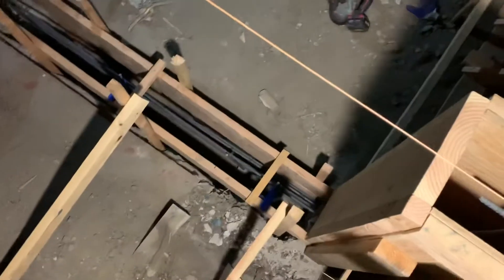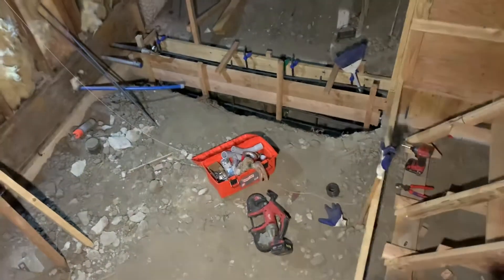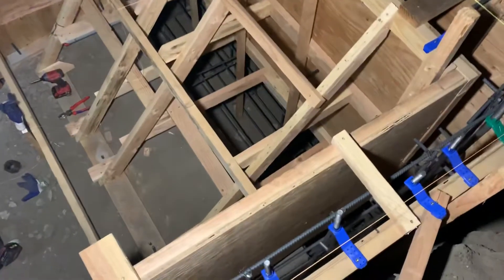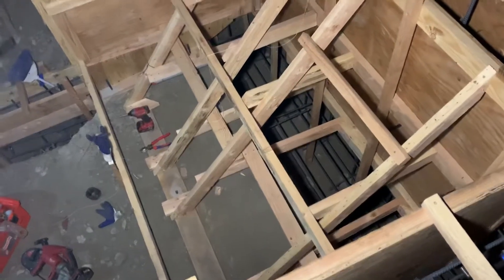When they pour it you're gonna have excess come out from the sides here, and they're just gonna try to keep it all contained within this middle area. There's gonna be some extra excess coming up onto the dirt, but we're just gonna fill it in the middle and use a vibrator to get the concrete to go around all the rebar and everything else. Same with this area right here between the wall and the dirt — you're gonna fill that up with concrete as well.